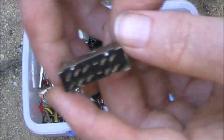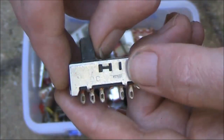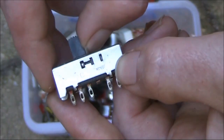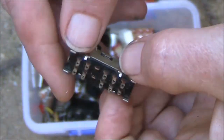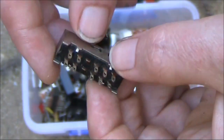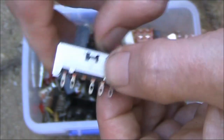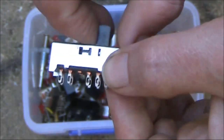Now this is an interesting one. It's really hard to work out what it actually does without a multimeter, but it's a multi-position switch. That could be useful if you are switching a lot of things, like coils and capacitors for a multiband receiver project. One thing to bear in mind is that these switches are fine for DC, but for RF there can be capacitance between the connections, which can spoil performance. So particularly on VHF and UHF, you wouldn't use a switch like this to switch RF signals, but it might be okay for a simple, cheap HF receiver project.